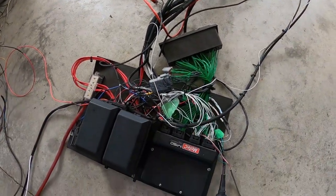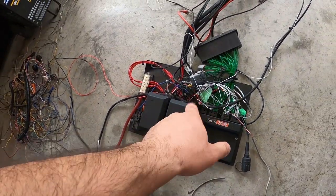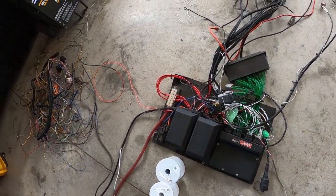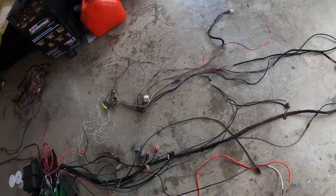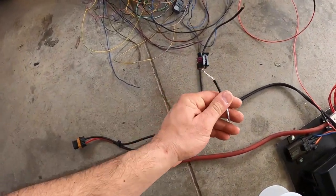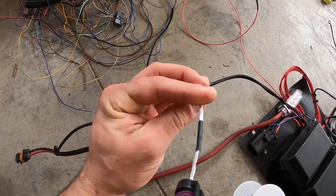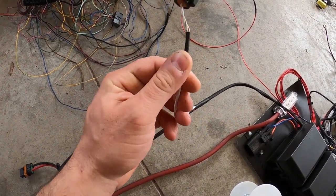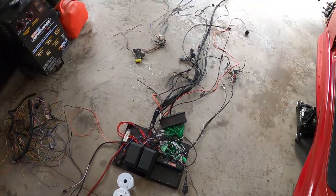These are the sizes I use the most. If you can see here, everything on the sensor side is 22 gauge, and then when I'm powering some stuff up I use 20 and 14. Also for very important sensors I use mil-spec shielded wire. This would have a shield on the outside of it just so it doesn't pick up any noise.